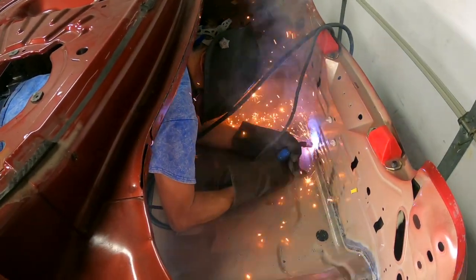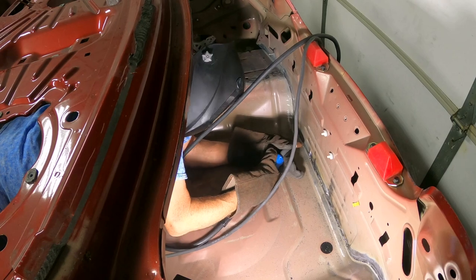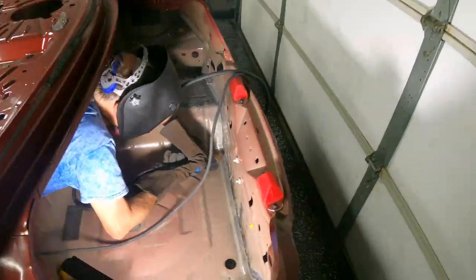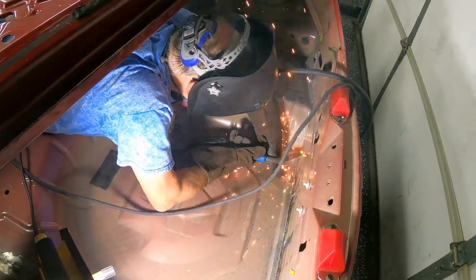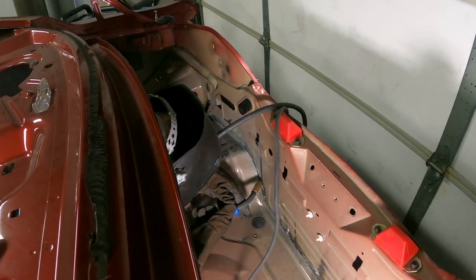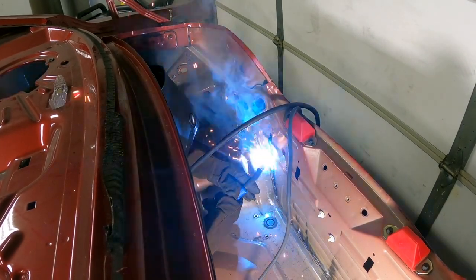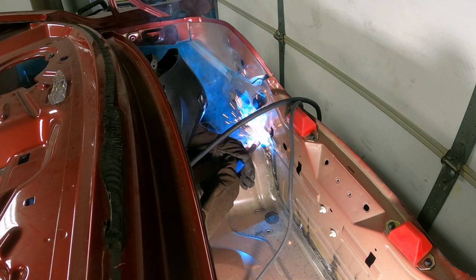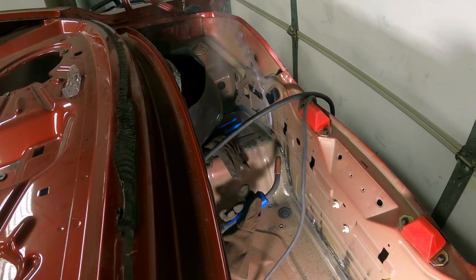You really need to make sure you're working at a good angle. One thing you hear a lot is to practice your welding skills in a whole bunch of different angles — this will be critical for the roll cage because sometimes we'll be welding above our heads or in weird, crazy spots. Dad first tried to do it from outside the car looking down, and it was really hard because the angle was causing blowouts. He found it was actually most effective to get inside the car, lay down, and work across it. A good reminder to always work from the angle that is most effective and try different things.